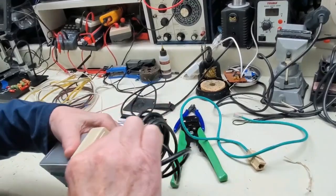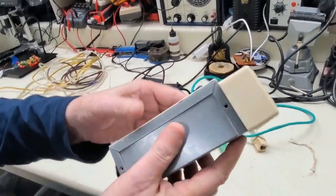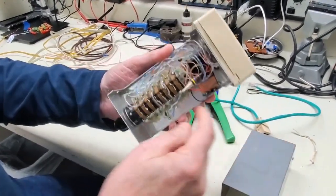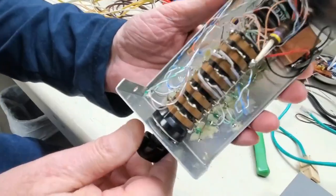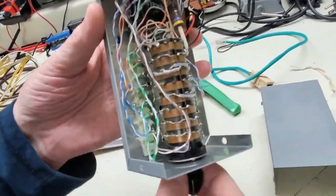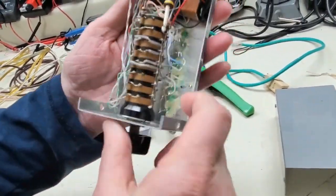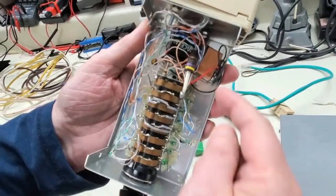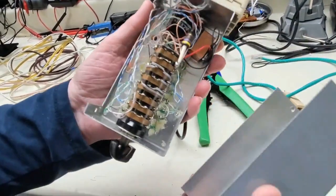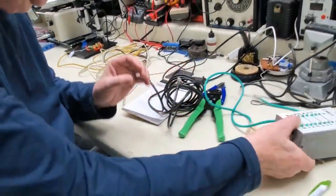And if you want to build one of these, they're pretty simple, if you can find the parts. I had parts in my junk box. Look there, I've got like a 12-position switch. Boy, it's got a lot of different wafers on there. I think I'm only using one. And then, of course, I just glued the LED lights in. I got a little 9-volt battery in here and a dropping resistor to drop the voltage. All right, but that's it. All right, so we know our cable's good.